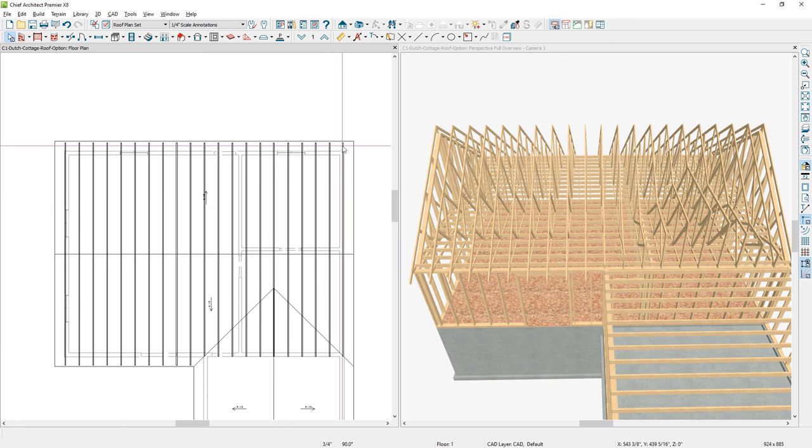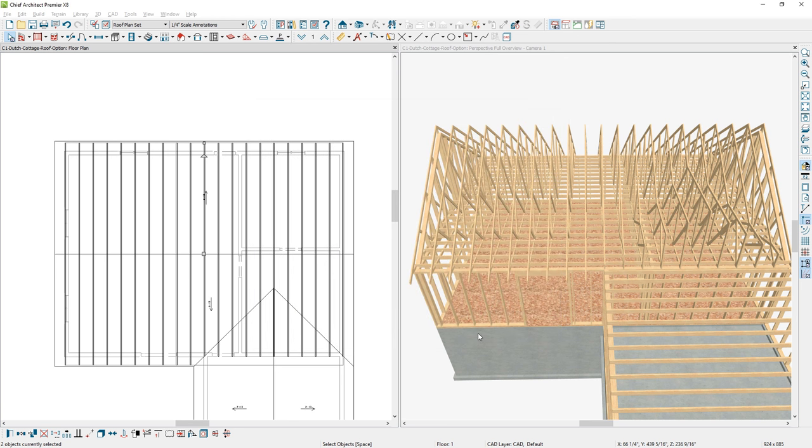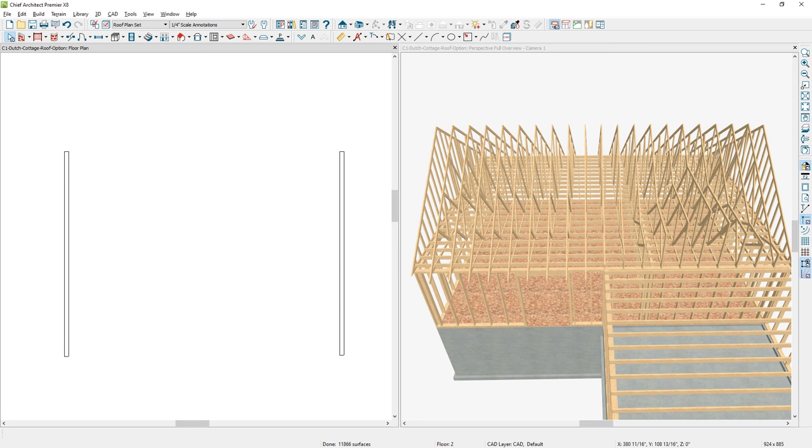Using the multiple copy tool, open up the interval — the default for roof trusses is 24 inches on center. Create a copy and pull it across to the other side of the wall. Zoom in to make sure the roof truss is exactly on the end of that wall. Now select the two end trusses, hold shift, and mark those as an end truss with a reduced gable, which lowers it about an inch and a half to allow for lookout framing. Force the truss rebuild, then go into the attic walls, grab those two attic walls, and force their rebuild as well.